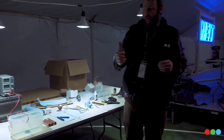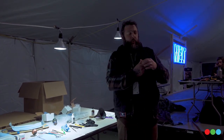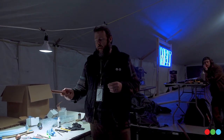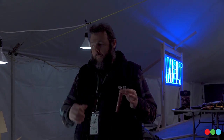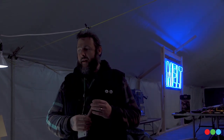Phosphorized copper, when you're electroforming with it, it develops a black film over it. And that's why I was starting to question if it was the right stuff, because I thought it was kind of getting my bath dirty, because if I electroformed all day, there would be this black film over the bar. Well, I got online and I did some research, and there's been some really in-depth studies about it.